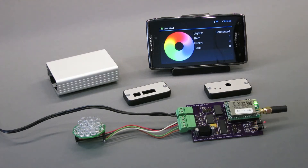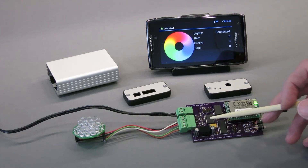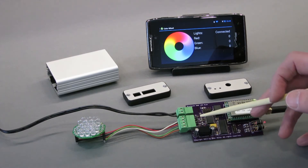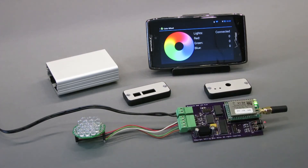The PIC18 does basically a gamma correction or a perceptual lookup to compensate for the non-linearity of the human eye's response to different colors. The PIC18 pulse width modulates the resulting levels, and it goes to a bunch of transistor drivers here that turn the LEDs on and off really fast.